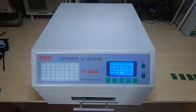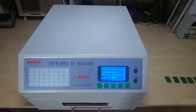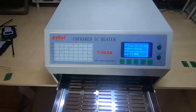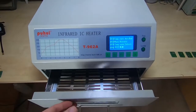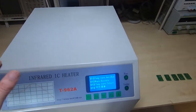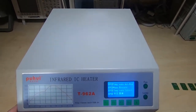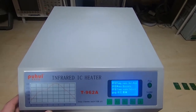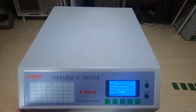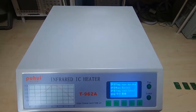One of the issues you get with low manufacturing costs is obviously quality. This unit is fundamentally a sound unit, but there are some quality issues you'll find when you first take delivery - things such as sharp edges in the drawer. These edges can be very sharp, but it's a minute's work to round them off. There are also several videos about some of the insulation used inside not being really suitable for the purpose. But when you pay just a few hundred pounds for something like this, it's extremely useful because you can get a sound working machine that needs maybe a few hours of work by the buyer to bring it into a usable state. I don't buy units like this and put them straight into use - I'll dismantle them, rework them to a certain degree, and what you end up with is quite a reasonable unit.